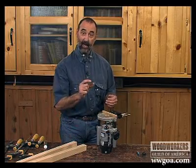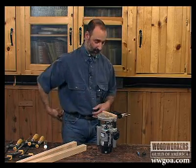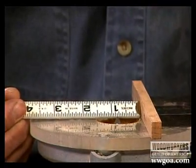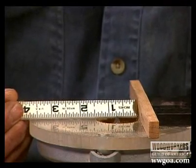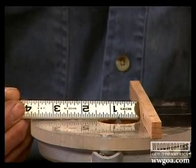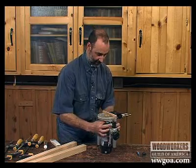In this case, I've got one and a half inch wide legs. I want the mortise centered on the leg, so the distance to the center of the mortise is three quarters of an inch. With the V-cutter, I can quite easily measure from the fence to the center of that bit and lock my fence in place. We only use the V-bit for layout, so now that's going to come back out.